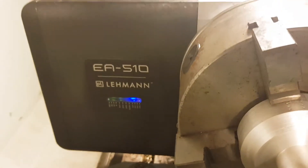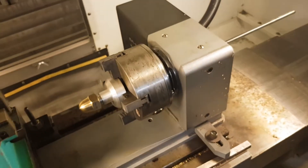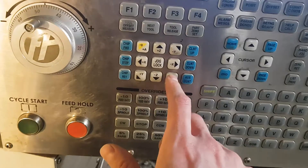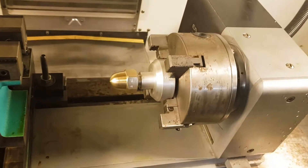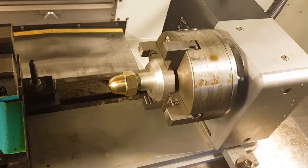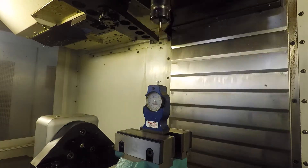This way I was able to use a nut on the 4th axis backside to tighten everything. The 4th axis is mounted in line with the X axis. For my reference tool I used a 3D edge finder, and I used a fixed dial gauge to set my Z offset.